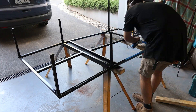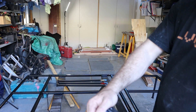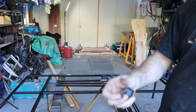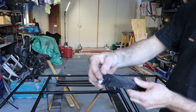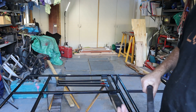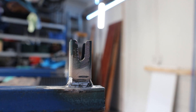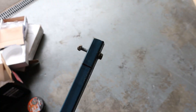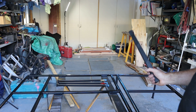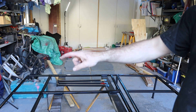While the paint is drying, let me go over a few design features on the metal section of the bed. For feet, you can buy these plastic inserts that sit inside the tube and cap it off — I've used a few of them as feet. You can also cap off any box sections to make it look a bit prettier. Where the legs meet the frame, I slotted out the frame so I don't have to remove the bolts entirely — I can just loosen them off, slide them into position and tighten them down. I've also spray-painted the legs different colors for a color-coding system.